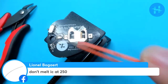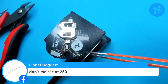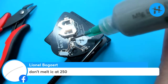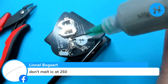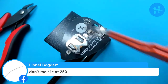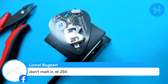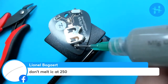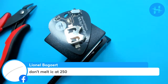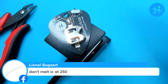That's actually melted on now — that's good. You might need a little bit more. So in this case there are no chips on the board — there's only a diode, a resistor, a switch, and a battery holder. That's why I'm fine with allowing this whole thing to — oh, look at that! That's beautiful. Let's add a little more — oh yeah, that's so satisfying. Let's do it on the other side as well, because I think this battery holder is going to need some extra solder, both for electrical contact and for mechanical purposes, because it's got to hold the battery holder onto there. Wow — you're probably not supposed to do it this way, so don't emulate me. But it is very satisfying. It's not as hot near the edges, which makes sense. Look at that — gorgeous. I'm going to turn this off now.